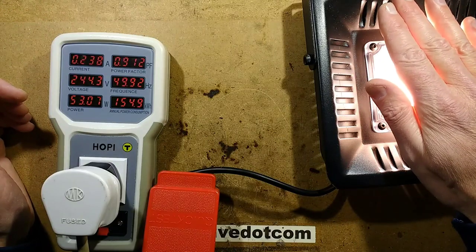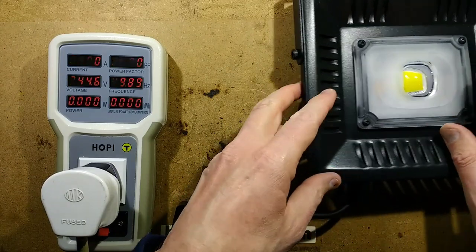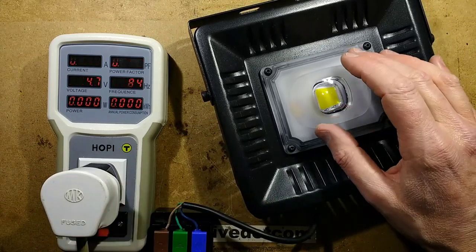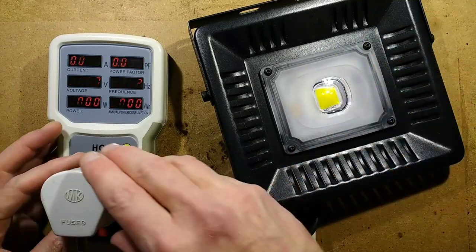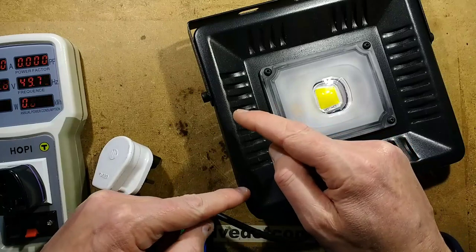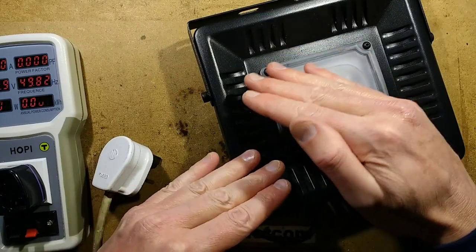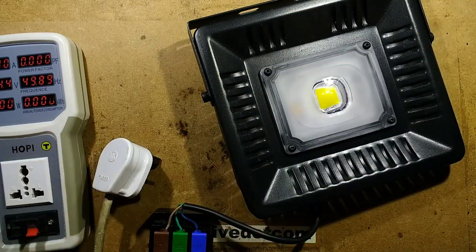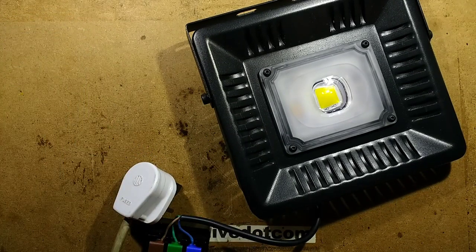That kind of alludes to just series arrays of LEDs. There are two types of approach: one is to have all the LEDs in series where the chip acts as a sort of variable current-sensing resistor. Another approach is to switch them in groups to ride the sine waves, so as the forward voltage of the first group reaches a certain threshold, it switches the next group in, making a longer string of LEDs lit for a longer period in the sine wave. So it's met its 50 watt rating — that's pretty impressive.